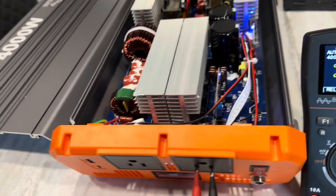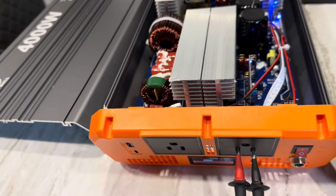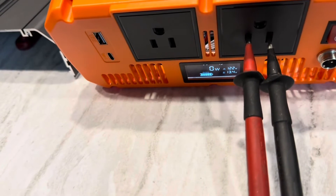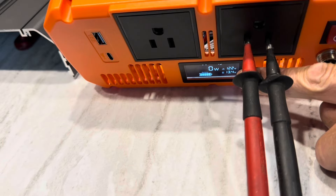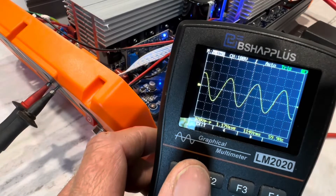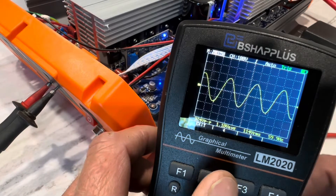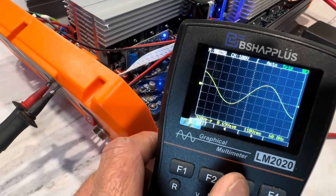Now let's see if we co-witness on the display. 122 on the display — can you see it right there? 122. Now I'm putting a little load to it to make sure it holds, and simple as that. And just a shot of the sine wave before I put a load to it — 59.9 hertz, the same as it ran before I turned the voltage up a smidge on it. Everything looks fine.